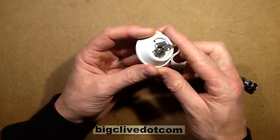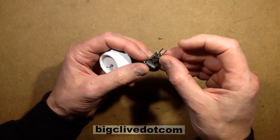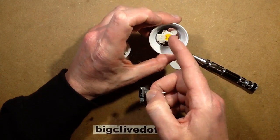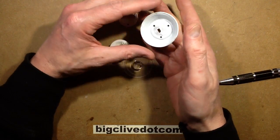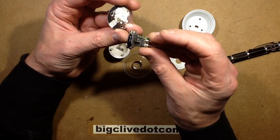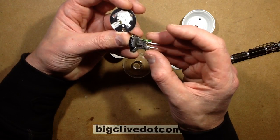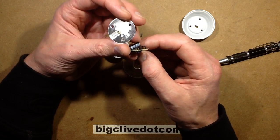Once you open it, you find that the circuitry inside has goop all over it. I'm not quite sure why — is it to hide stuff, for thermal dissipation, or to prevent vibration? It's that peel-off goop. The circuit board itself has two pins coming through, and it's got heatsink compound that couples onto this aluminium alloy shell. Those two pins go into a fairly conventional switchmode power supply with the usual rectifier and dedicated chips to drive the LED. It's got a little inductor — I'm guessing in this instance it'll be a buck regulator.